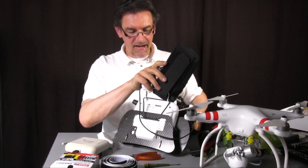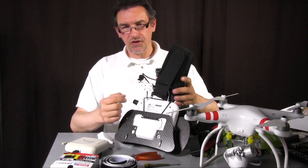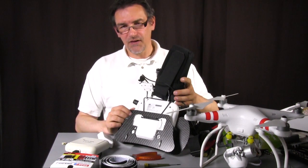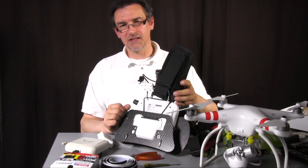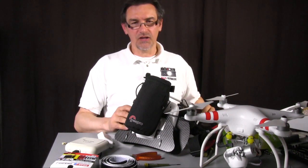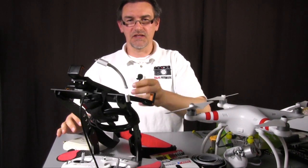It's very easy — here on the back side of the remote control, just under the lever where channel 7 is, there's another hole. When you turn the screwdriver to the right side you will have a little bit more power — 100 milliwatt power. When you turn on your remote control it beeps two times instead of one time, so that's the sign that you changed the power. But please make sure that it's allowed in your country — in Germany it's not allowed, so in Germany you can only use the less power.